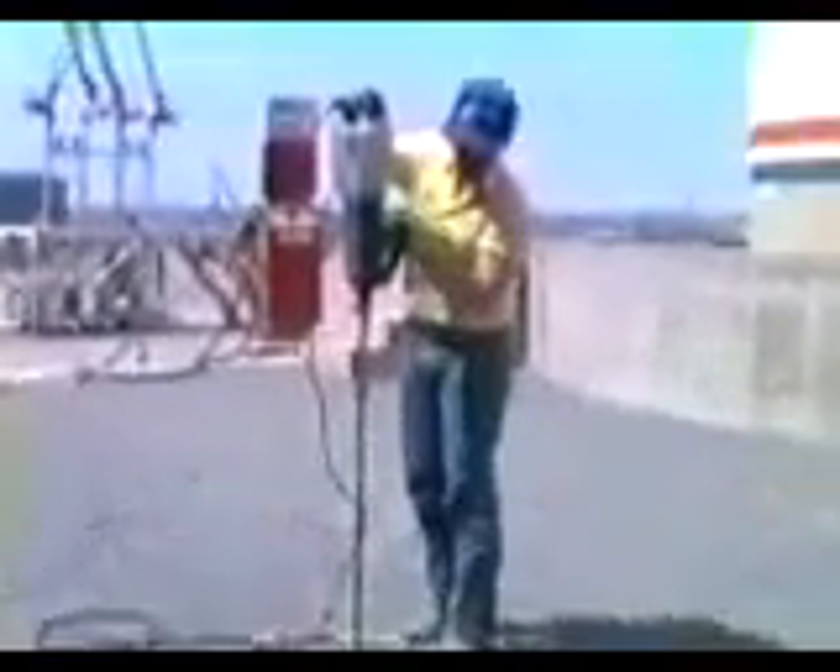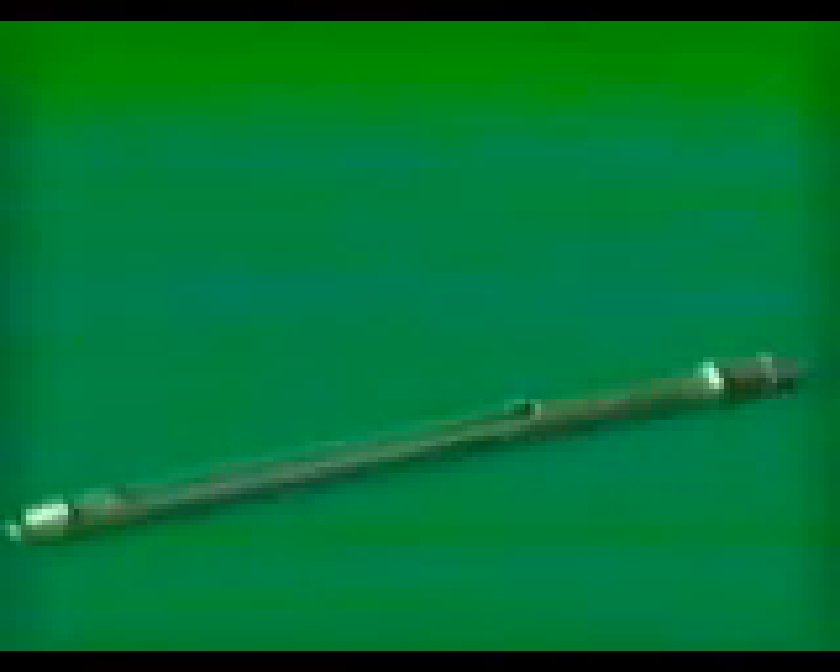Place the assembly in the pre-drilled hole, attach the hammer drill, and drive as before, adding extensions until your required depth is reached. When the dedicated tip reaches your required depth, remove the extensions and tip drive adapter from the hole, leaving only the dedicated tip with its umbrella and Teflon tubing in the ground. The tubing can now be terminated and finished off at ground level according to your individual testing requirements. You can also take soil samples at various depths with the new AMS 5/8-inch soil probe, sold as an option with this probe kit.